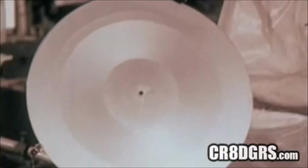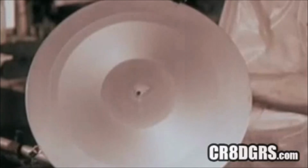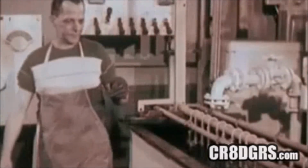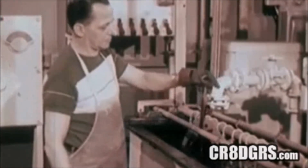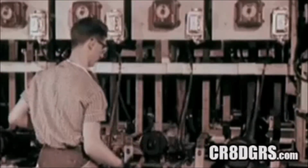First, a fine-grained deposit of nickel. This makes smooth-walled grooves and a quieter surface. Next, a thin deposit of copper over the nickel. A nice, smooth salmon pink. Now, a whirling bath in another tank. A much heavier buildup of copper. We'll see why in a moment.